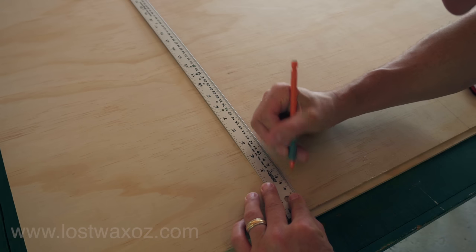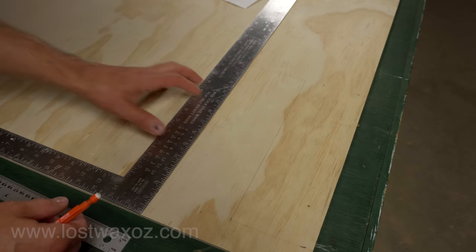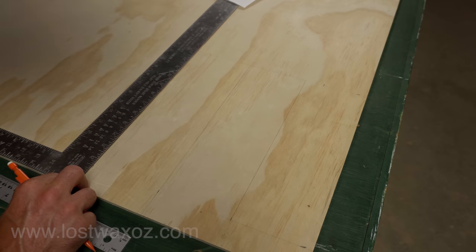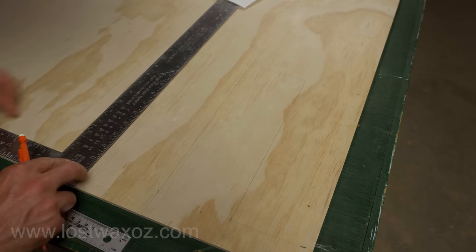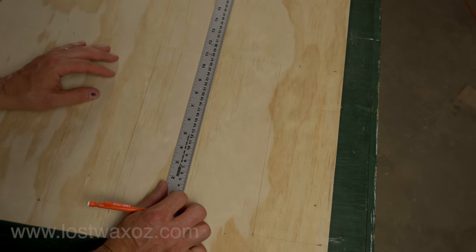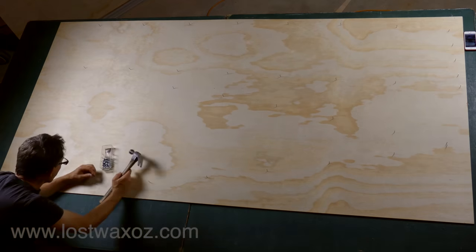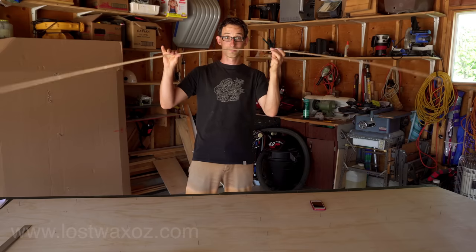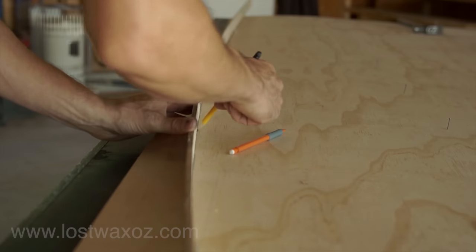You can see my famous hand crawling technique here, kind of like a spider with one broken leg. I followed the pattern and measured out a specified distance on each side of the long line at each 300 millimeter mark, and when I connect those dots that should give me the outline of half of the bottom of the canoe. For the sides, the measurements start right from the edge of the board at each 300 millimeter line. Marking the line for the end of the canoe was a little bit trickier — I needed to divide my last 300 millimeter segment into more segments, then measure out along each of those lines to define the front curve. I grabbed some skinny little nails, put a nail in each mark, then grabbed a nice flexible piece of wood and held it against the nails so I could draw a smooth curve.